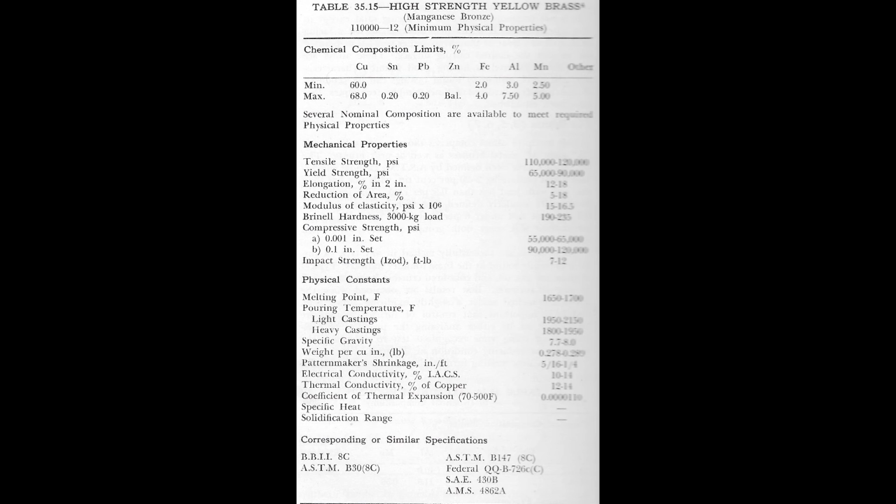Manganese bronze is melted in most any kind of furnace used in common practice in the foundry industry. However, the major part is melted in individually fired crucible furnaces, either stationary or tilting, utilizing either gas or oil as fuel. Don't forget, this was printed in 1957. I would change that portion to say that now it's probably all being melted in induction furnaces. But if they said it was typically being melted in gas or oil fueled furnaces, you with propane gas should be able to do it too.